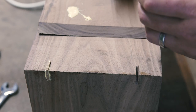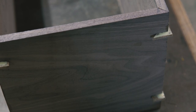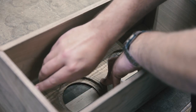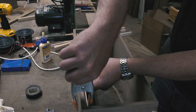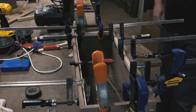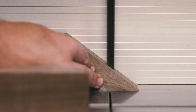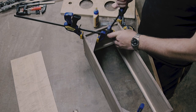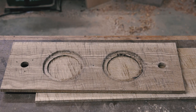While the glue was drying on the splines, I put the box around the panels, but I used a thin piece of scrap to inset the panel just a little to give a small shadow line on the finished product. I glued some small pieces of scrap to my line all the way around the front of the box to act as a ledger for the front panel to glue to. And for the back, I had some thicker triangular cutoffs of walnut I glued into the corners that I'll be able to screw the back panel onto in case I ever need to remove it.